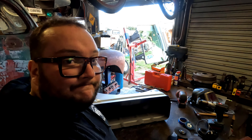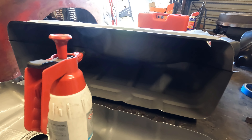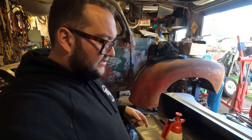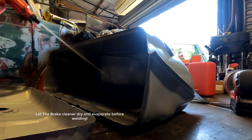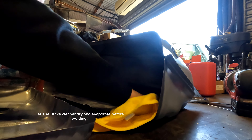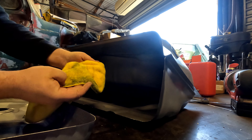It will probably rust inside, so I'll give the inside of the tank a bit of a clean. I'm going to use some brake cleaner — Worth brake cleaner, pretty expensive but good stuff — in a spray bottle and give it a good spray and wipe out with a brand new microfibre cloth so I don't put any more dust and dirt in. I'll tack it up, go and make sure it fits in the car, then probably cut the tacks and cut the hole for the sump. We also need to put a dash-8 return into the top corner of the tank.